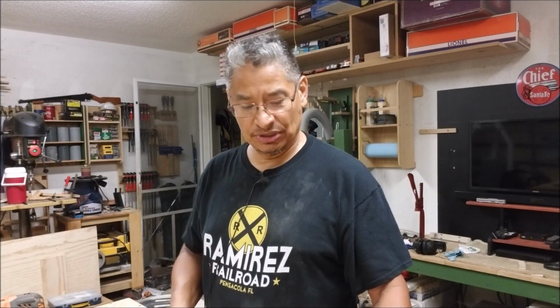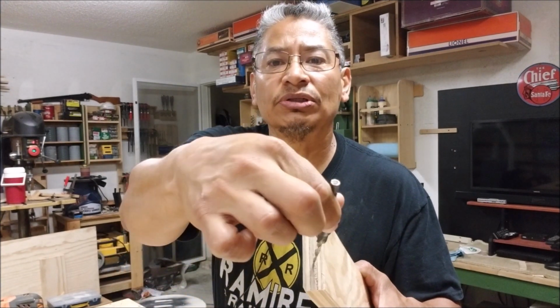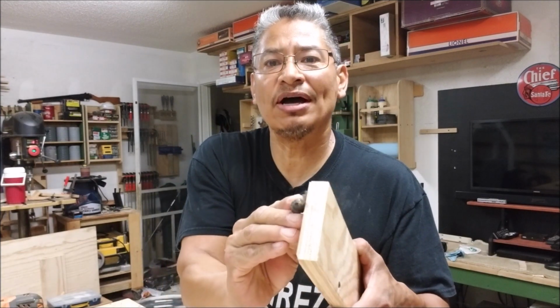And when you got a drill on the side of it, and what I mean by the side of it, if you look at your board and you got to put a hole on the side just like this, you don't want your bit to be crooked and actually blow out the side of your workpiece. Your screw is going to follow the hole no matter how hard you try. It's going to follow that hole.